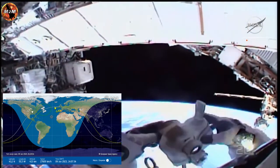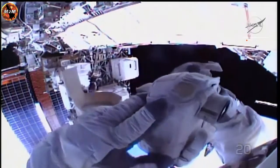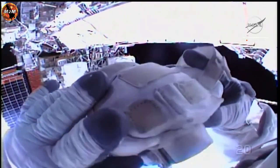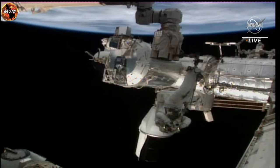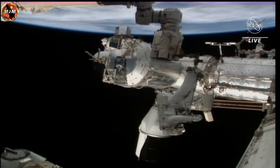Okay, Kenny, I've got Bravo 3, 2 o'clock plus 2 set up. There were 20 turns on the lower IROSA with a good white band. Copy, I release. I understand R5 on the lower IROSA is released with 20 turns. You should be pretty much at the bolts for C2. We are going to work on releasing these anti-rotation devices, so you can attach an adjustable equipment tether from your small trash bag to the ARD tether point. Okay, we need to get that done.